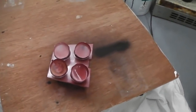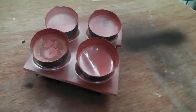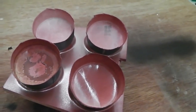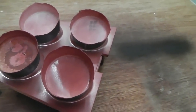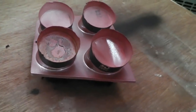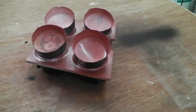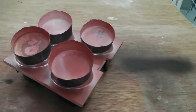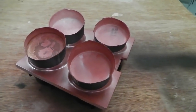Let's do it. Okay, between jobs and getting the dial faces ready, we need a little pod gauge. It came in chrome, fully over chromed first, so we mask off. Convenient use of some paper cups there and a little bit of masking tape just to shield the ring faces. The pods have a chrome ring on, they do on this model, it's a special. So over chromed that dash pod, and then we're satin black on the inside, and then a special paint that just slightly bites into the chrome, and then we're off. And that's colour matched into the car body scheme.